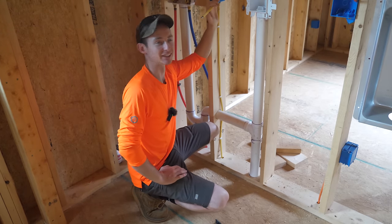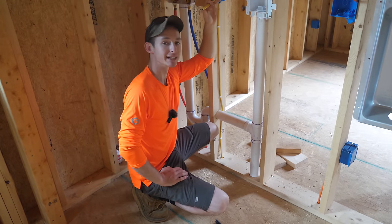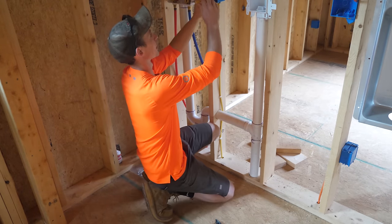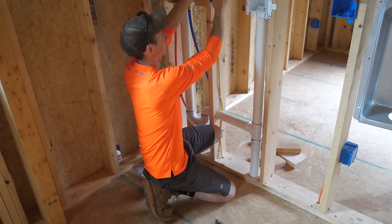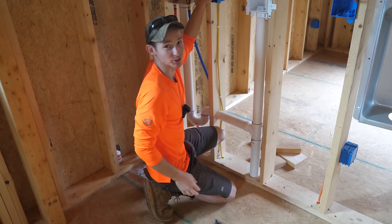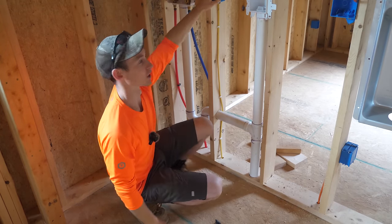At the top of the box here I'm leaving about six inches, just sort of doing this with my finger to the front of the box. That should leave plenty for wiring the switch up and I'll be able to curl this back up into the box — that's what we'll do for roughing. We try to coil this up and push it back in the box as far as we can, so those pesky drywallers cannot cut the wire with their RotoZip tools when they go to cut the outlets out from the drywall.